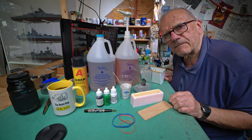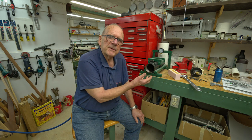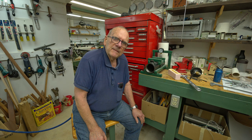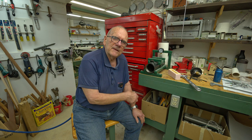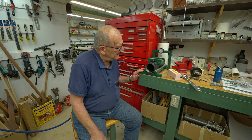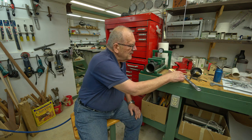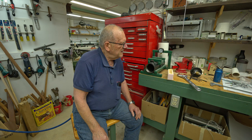Let's take the camera down into the workshop and I'll show you the pressure pot we're going to put this into. Here we are down in my workshop — here's the pressure pot. It's nothing more than a small hydraulic cylinder. In case somebody's going to think it could burst — it won't burst with 130 pounds or whatever my air system has. This thing's rated for probably well over 3,000 pounds.